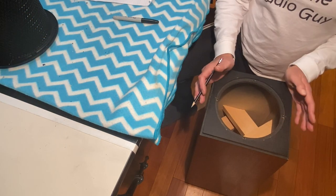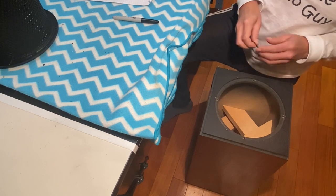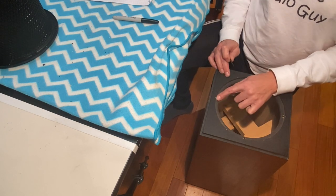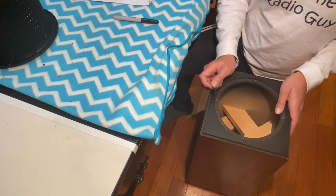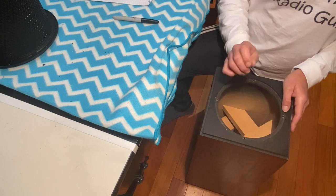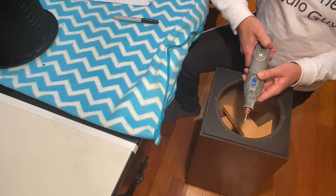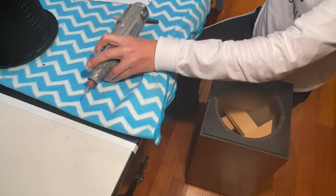When I first saw this, I realized that if you just follow Ohm's instructions and you just drill a hole here, you're going to have a mess, okay? I can't just drill a hole and drill that through there. It's going to start chewing up this corner, and this corner, and this corner. Ohm, again, great company, but this alignment is not the best. I'll just say that, okay? So what I did on the first one, I used this router bit on the Dremel to open up these areas where the screw is going to go.